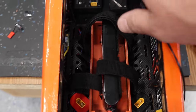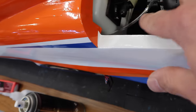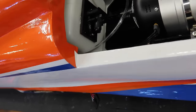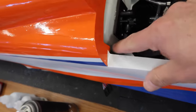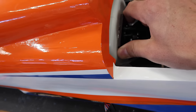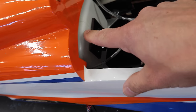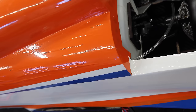So we're pretty much installed here on all the equipment in the front. We've got most of our plugs installed. There's a few little things to tie up there, but earlier I mounted our on-off valve to one of our Cortex gyro boards. Initially I was going to put that on the side wall here. The problem with that is the tube has too hard of a bend on it. So what I did was I Shoe Goo'd this plate onto our tank. Now, not a whole lot will stick to this poly tank, but Shoe Goo sticks very well.